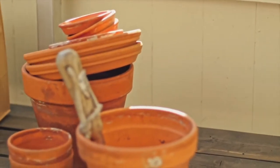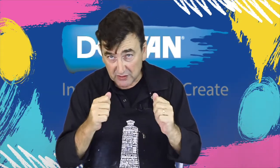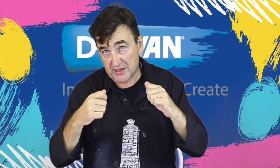But porous surfaces such as terracotta, all types of wood, MDF, masonite, pretty well anything that's porous, the clear sealer once again will bond really well with and allow the paints to stick. And an added benefit of the clear sealer in those really porous surfaces like say brickwork or terracotta is it will block up the holes so that you don't lose all your paint or whatever it is you're painting over the top into the cavities. Because of its long chemical chains, it tends to block those holes up and then allows a nice even surface for you to paint over.